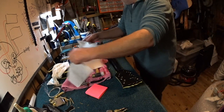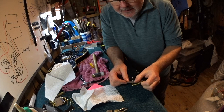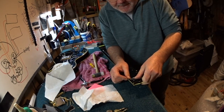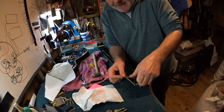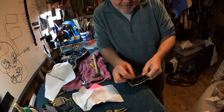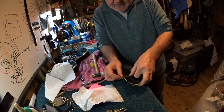And then, while it's still a little bit moist, if you've got a new blade, which is what you really need, you have to go and buy some more, then you get your blade and you just carefully snip back your little stumps. Now we can fine tune them a bit later, but we can just get rid of the bulk of it for now. I bend the blade upwards just so I minimise the area of blade that's touching the finish. It just does the cutting bit and nothing else.